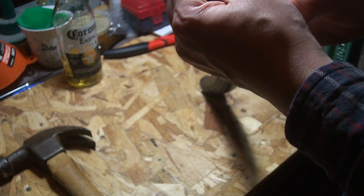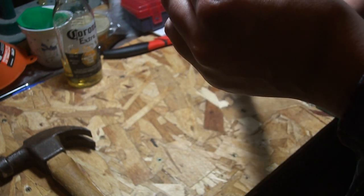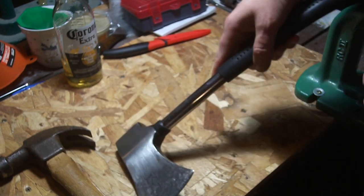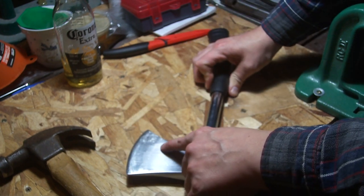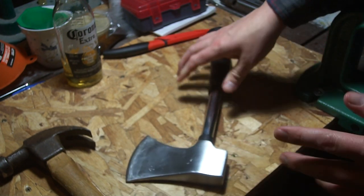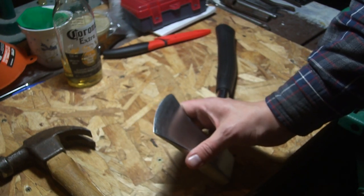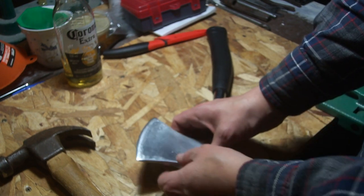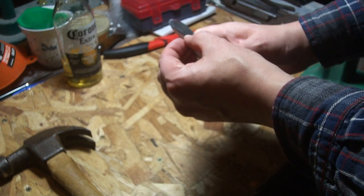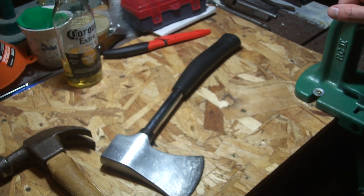I think that's about as much angle as you want — it's still thin enough it'll cut, and it still splits fairly well. That's far better than it was originally, which was quite blunt. It has a pretty good hardness line there. It's not over-hardened, obviously, because you can cut it really easy with a file. So it's not going to chip — the worst it can do is dent the blade if you hit something really hard. You can file that out fairly easily. It seems to have quite a bit of life before you get into soft steel. Anyway, I think it's over like nine bucks or something — probably worth it. Thanks for watching.